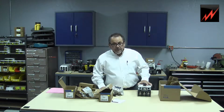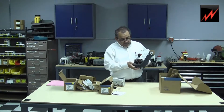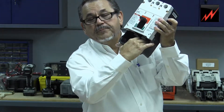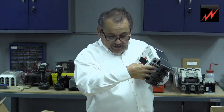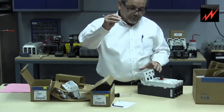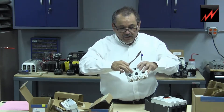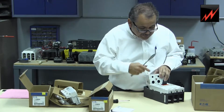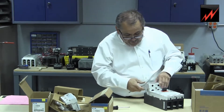I'm back now. What we're going to do is insert the thermomagnetic trip unit into the case here. This is a little different — as you can see, there are some screws right here. These are the screws that will screw down the trip unit against the metal conducting elements. Here's where the terminals face out. We're going to slip it in. We're going to be using this tool here — just a flat spade type of tool. And this little red button we're going to hold down, because when we insert it into the case, it usually snags on the center mechanism. This enables us to get a smooth entry and seat the trip unit.